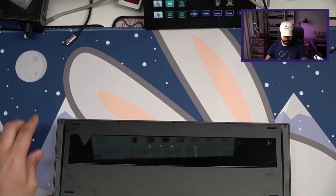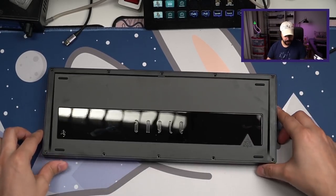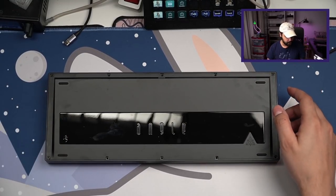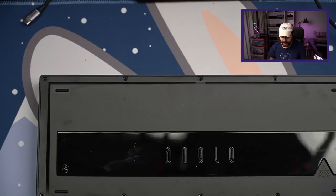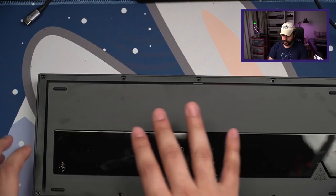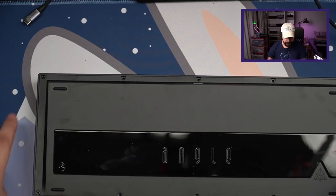All right. Now, finally, finishing quality. The quality of the finishing, the anodization itself is good. Again, please do not pay attention to my terrible fingerprints, but I don't see any splashing. I don't see any large grain. I don't see any changes in texture. Those are the things that I'm looking for when I'm looking for bad anodization. It's very consistent. The size of the grains are uniform across the board. It is a good black anodization.